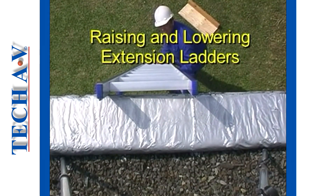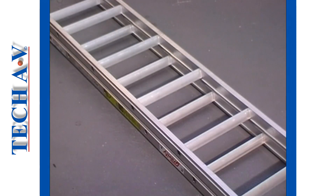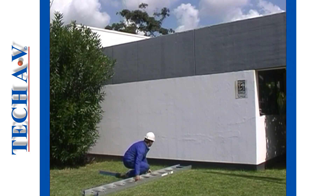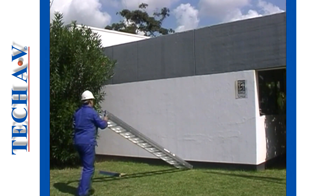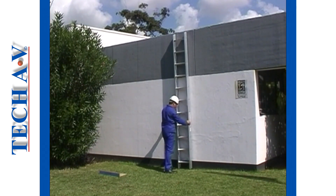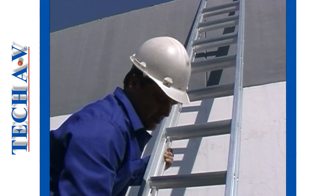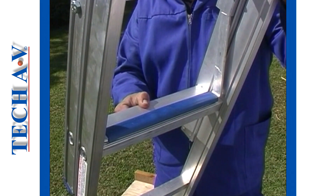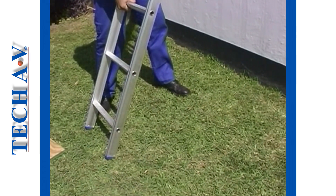Let's look at the process for raising and lowering extension ladders. In this first demonstration, we have a lightweight or commercial-grade extension ladder with a push-up fly section. This type can be handled easily by one person. Raising the ladder involves walking it against the structure until it is upright, then setting it at an angle so that the fly section can be raised. The fly section is raised until there is at least a three-rung overlap past the upper support point. Ensure the rung lock rests fully upon the main section, then set the angle of lean as previously explained.